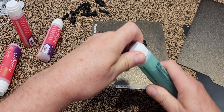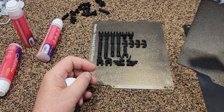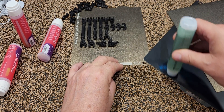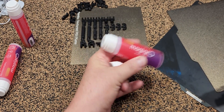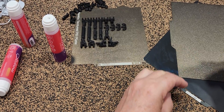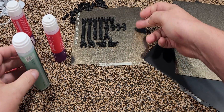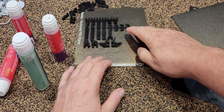With the Bambu glue, because it's thinner, it doesn't dry up as much and stays a lot more workable. Because of that, you're not pressing as hard — the flow of glue is much better and it's just an easy glide-on mechanism. Very gently. That's how these Magic Goo applicators start off in the beginning, but fast forward — because of the thicker glue on a powder-coated bed that's like sandpaper, it chews these up.